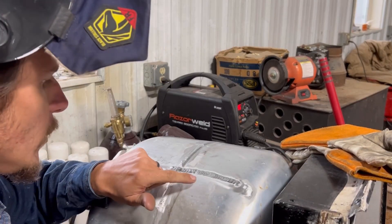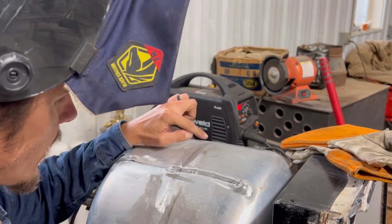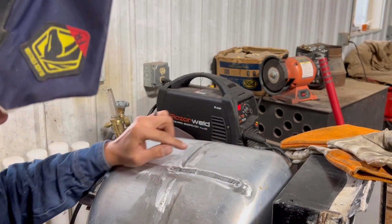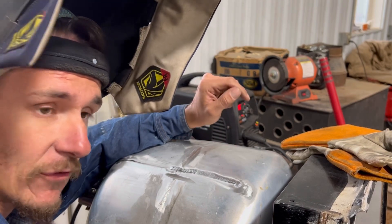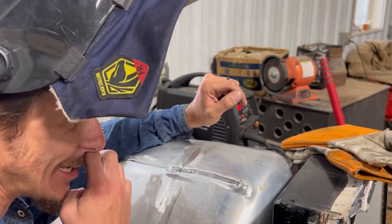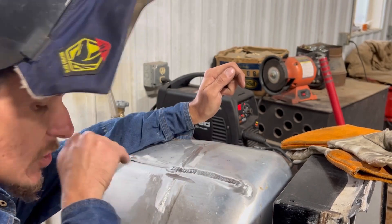What we have so far is looking pretty good. When I heat it up right here, a new crack opened up right in the seam. So we're going to finish this repair and then grind this out. It looks to me like whoever previously repaired it did not get a full penetrating weld, which is vital on a pressurized vessel like this. So I'm just going to go ahead and grind that out — but first I need to finish this weld.